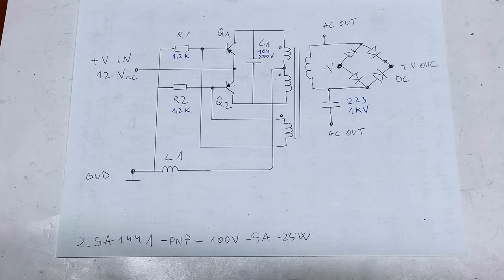The principle is very simple. This transistor is closed one at a time. And when it closes the circuit, this winding makes an output voltage, and in the next cycle, the other transistor makes opposite voltage on the output winding. You can see all the details in the link in the description.